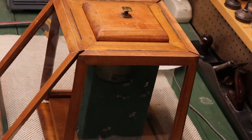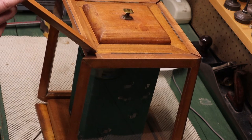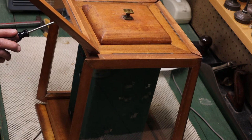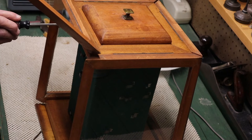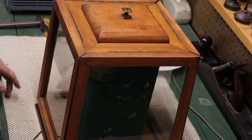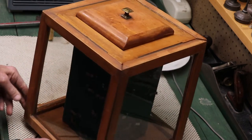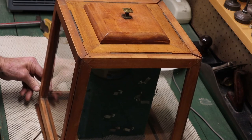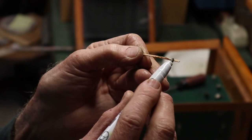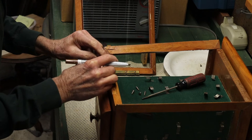There's a little bit of spring, so I'm going to show you how I deal with that. I'm going to put small wedges made out of toothpicks — shims — behind there to try and relieve that hinge a little bit. Just by loosening the screws, it made it much better. I'm going to take a marker and color a toothpick in the general nature of the overall piece, so when it's down in there hopefully you won't see too much of it. Because when this is reassembled, that will actually be on the top.